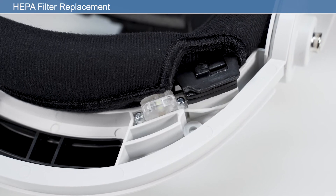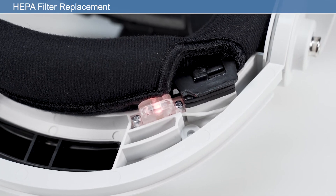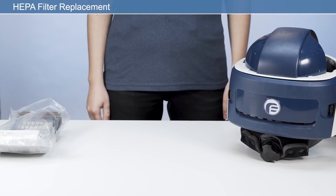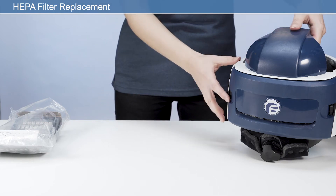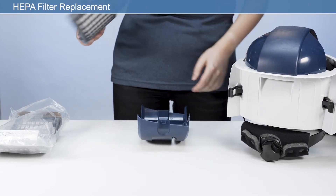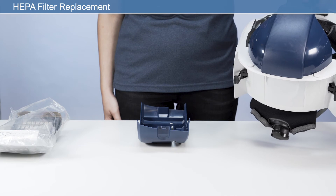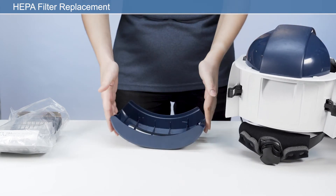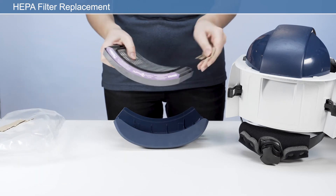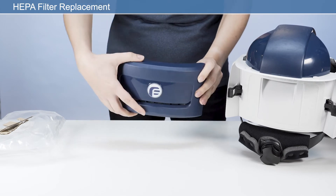When the status indicator LED illuminates red, further investigation is required regarding the condition of the filter and/or the battery. If no fault is found on the battery, the HEPA filter must be replaced. Open the filter cover by releasing the latches on both sides of the respirator and remove the filter cover. Remove the contaminated HEPA filter and pre-filter as applicable and dispose of the used filter responsibly. Be sure not to allow any dirt or elements which may obstruct the airflow to enter the air inlet whilst replacing the filter. Insert the HEPA filter correctly into the filter cover housing with the filter label facing upwards, then refit the filter cover into its original position.